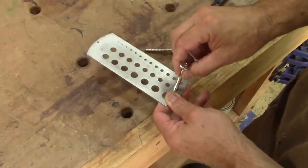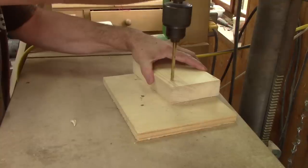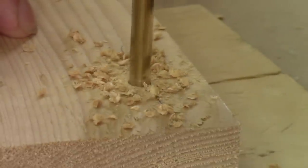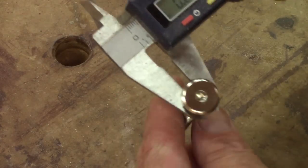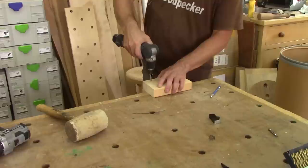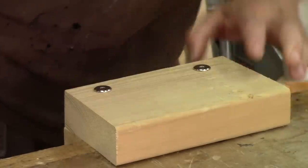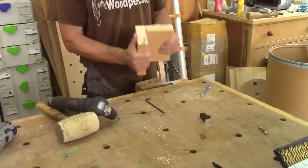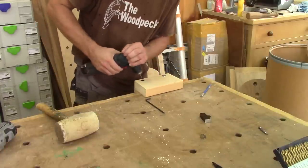On one of the pieces to assemble together, it's better to drill a hole to the size of the screw. After finding it, you just drill it. Then, you also need the size of the pilot hole needed for the screw and drill it also. Then it's possible to screw this together. When it's done, we have a sturdy joint between two pieces. The beauty of it is that it can be taken apart and put together again.